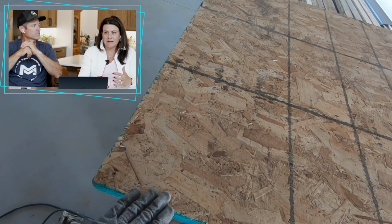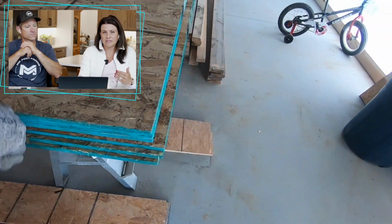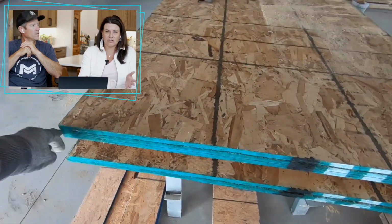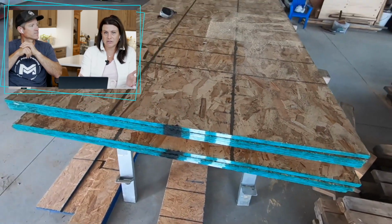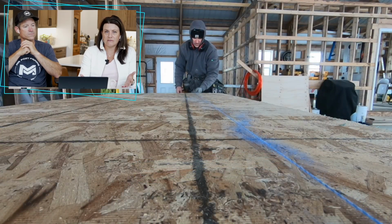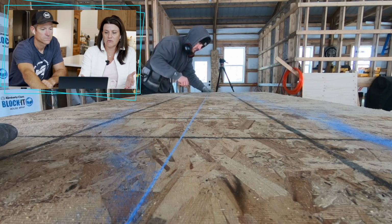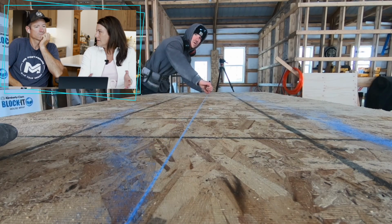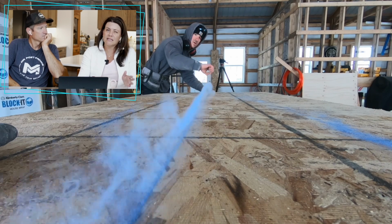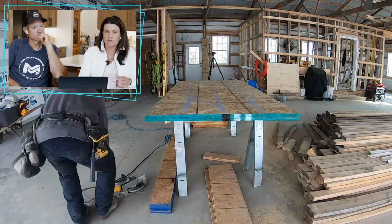Sure, yeah. And if you live in an area where you have a series of inspections, one way to be able to go in this same order is just to set up an additional framing inspection to get your exterior frame passed. And then you can put your spray foam in, then you can put your trades in. Otherwise, if you wait until all of it's roughed in, you're going to get spray foam all over all your wires and plumbing, and it's going to be a lot harder for your contractor to get a really consistent, smooth finish on it.